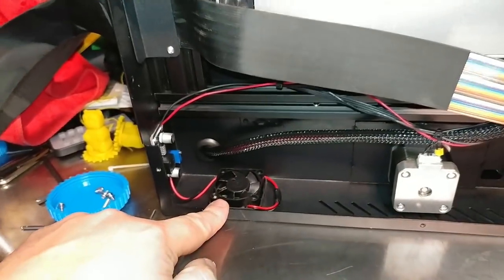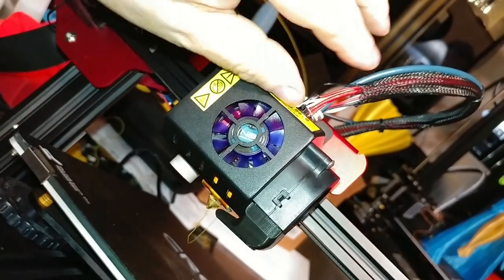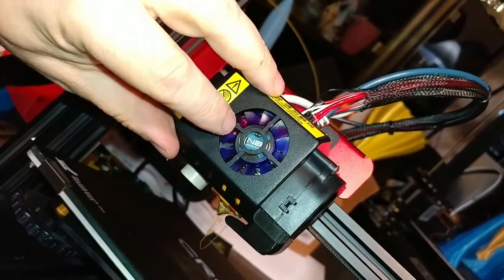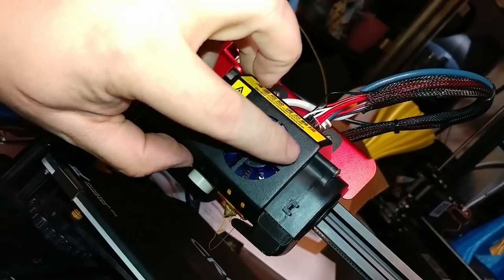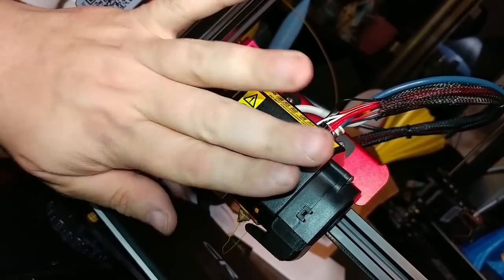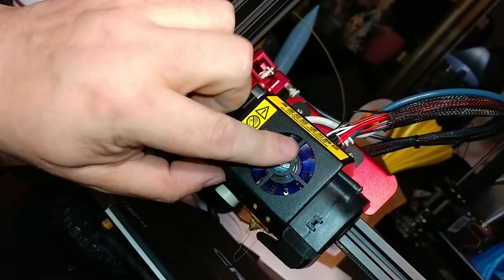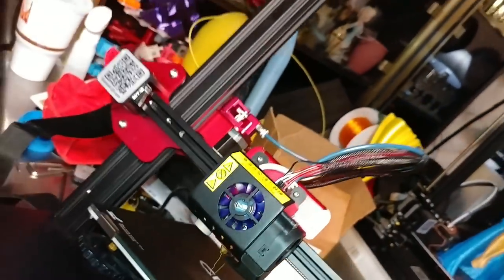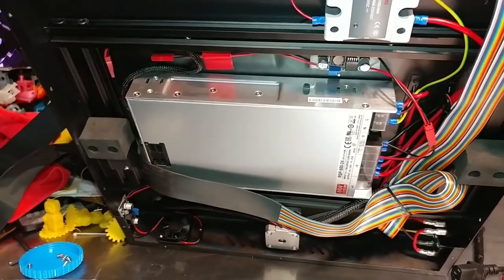Another small modification I've made on both this fan grill and the fan grill on the front of the machine: I got rid of the second set of bullseye vanes in here - I just took a pair of snips and snipped them out. This provides a lot less restriction for the fan's airflow and noise, but still keeps you from sticking your finger in there too easily. That gives you better airflow. So now this printer should be damn near silent - stay tuned.